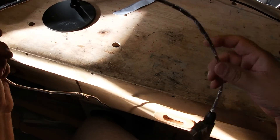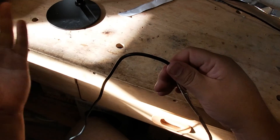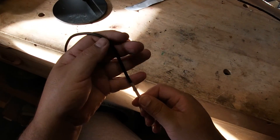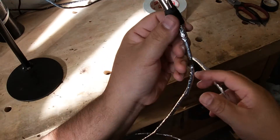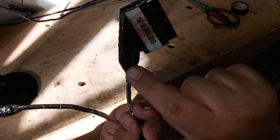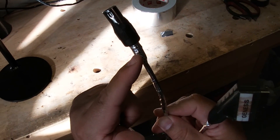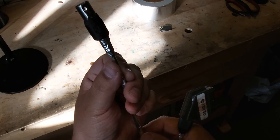As you can see, I've got basically half of the cable completely shielded with aluminum. The next step is to go ahead and repeat on the other side — I won't record that because it's redundant, but you get the point. Just make sure you tape the cable right down the middle so you can wrap it up. I went ahead and completed the shielding of the SCART cable and, as you can see, it's shielded from one plastic tip all the way down to the other. I'm going to go ahead and tape it up with the electrical tape now.